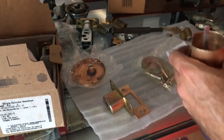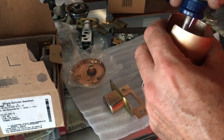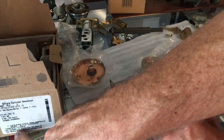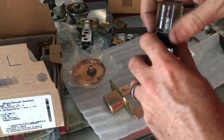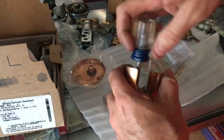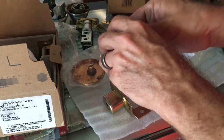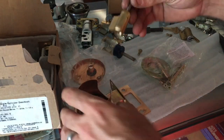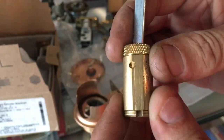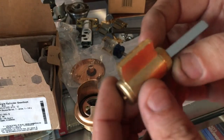And if we take it apart, we can see that we have solid brass cylinders. Now, this one is circa, on the box right there, 8/9/16, so 2016. I bought these as a special order last year. I'm going to hope that they still make them with solid brass cylinders, but I have not ordered any 560 lately. But we can see this is our traditional good solid brass cylinder. It's actually an Everest prep cylinder ready to go for Everest as well, and they just use the Schlage C core.